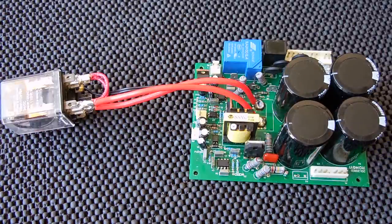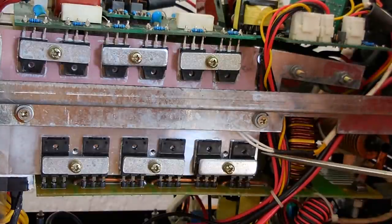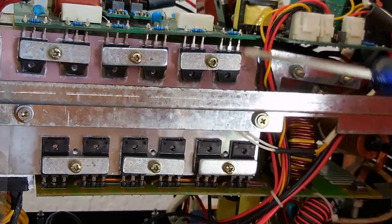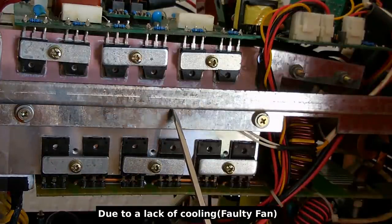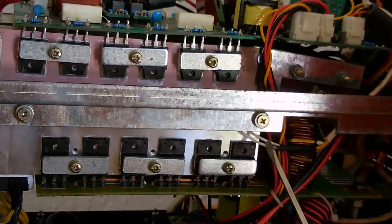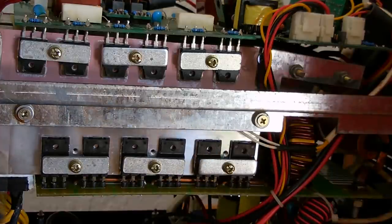When I turn the unit on, if the fan powers up then I'll know the board is working properly. Over here you can see two white wires going to a thermal switch located right behind this rail which is screwed directly into the large heat sink. If this becomes too hot, the normally open sensor will close the circuit around 80 degrees Celsius. To test this I removed it from the unit using the continuity setting on my digital meter — no continuity at room temperature. I placed it in boiling water, heard it click, and the meter came on. It cooled off and went back to normally open. I reinstalled it with new thermal compound.